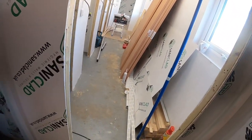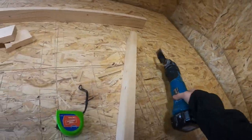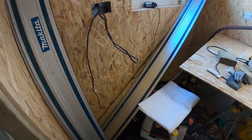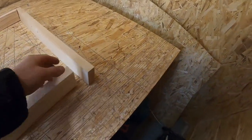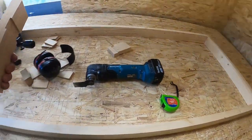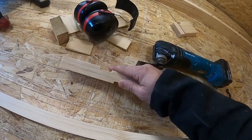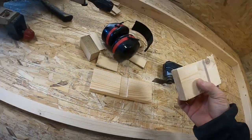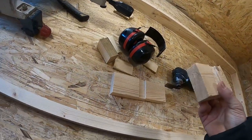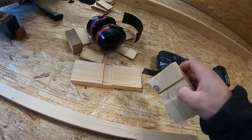Once you've trimmed your lining to the size needed, screw it together. I had to rip it down to 17 mil for my wall. I'll screw it top and side — when you get a two-foot door, linings aren't made for two-foot doors; they don't have a slot for two-foot doors. You've got two-foot-nine, two-foot-six, and other measurements on these, but lining sets don't come with two-foot, so you'll have to do your own measuring out and cutting.